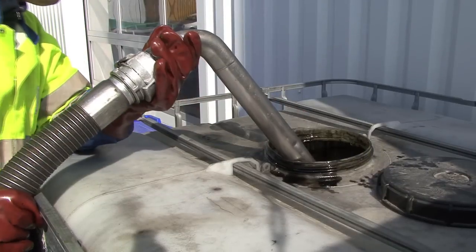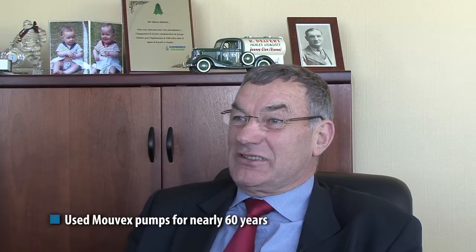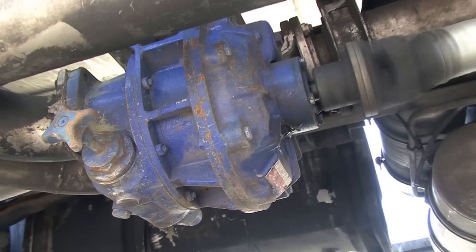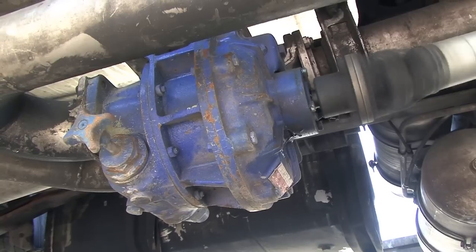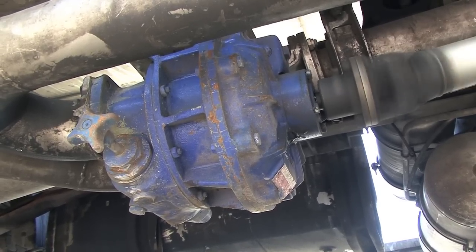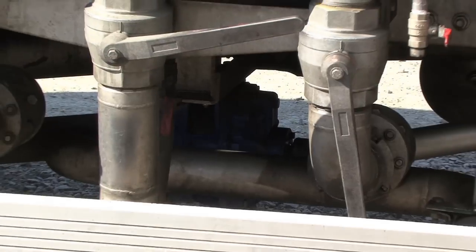The most important point in our work is the pumping of the waste oil product. We have opted for Movex pumps for nearly 60 years, because my father started with Movex pumps, which were eccentric pistons in those days, but were followed by the disc pump, which was virtually the same principle but more or less modernized. And today we have the CC20, which is really a specialized tool for motor oil pumping.